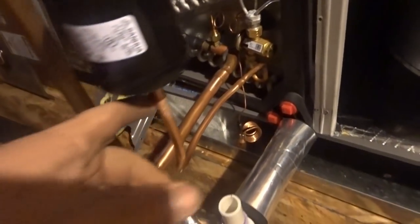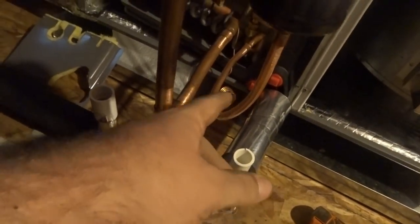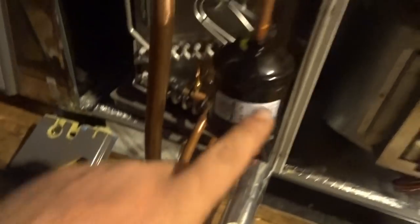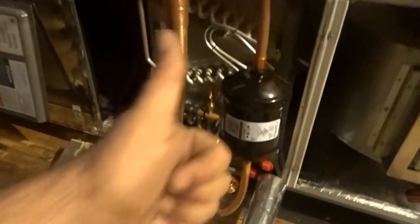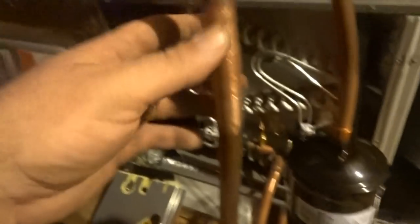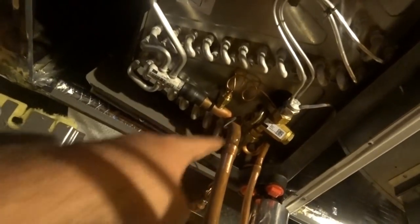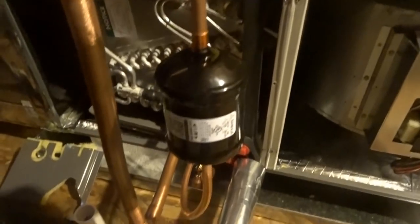We're still on our way. I have some of my copper tubing fit up. The liquid line's kind of janky looking — I'll straighten that out after we're done. Once I put the insulation on this line, I can tape it to that line, including the dryer. I actually put the dryer up here next to the air handler. I'm going to start the nitrogen, bring the wet rag up here to block off the valve areas. It'll be like the first time I've used a wet rag, really.